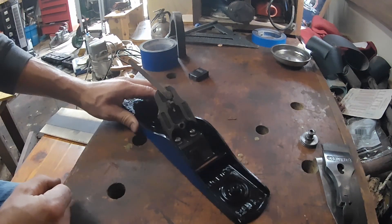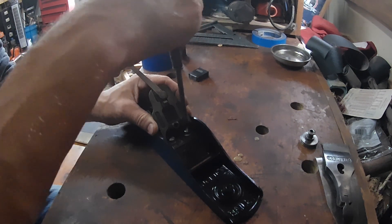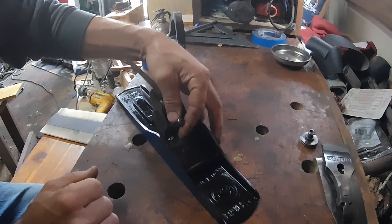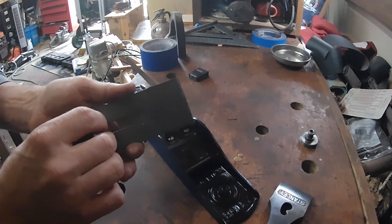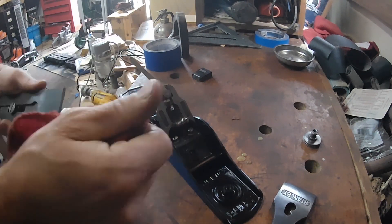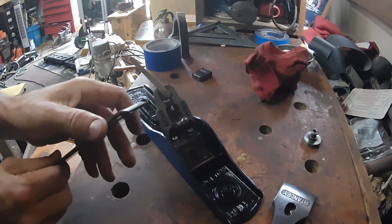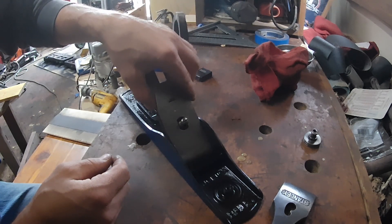The number five does not have that back adjustment screw, so we make the adjustments just with those two screws. We're going to try to get it very close — this will probably take a couple of tries to get it spot-on. Just snug these down and put the screw that will help hold the iron in place. I have not sharpened the iron yet either; I'm trying to get the hand plane put back together first. We'll get the chip breaker a little bit closer to where it would be, then we'll take this all back apart anyway.